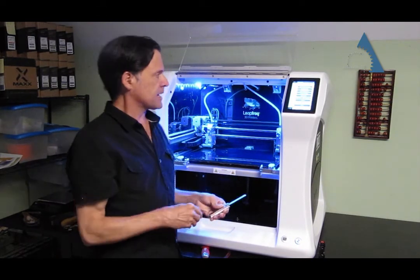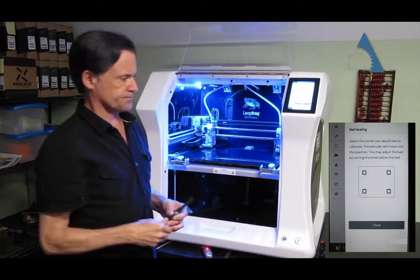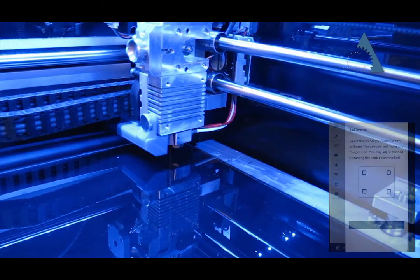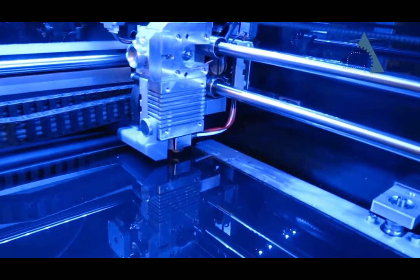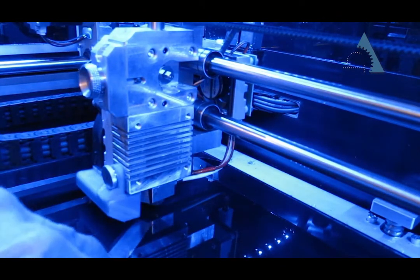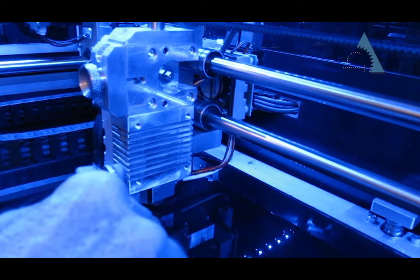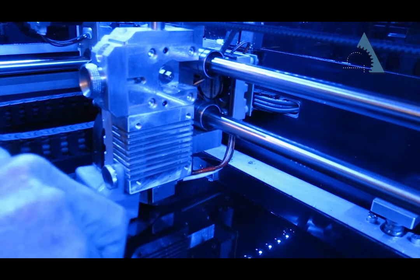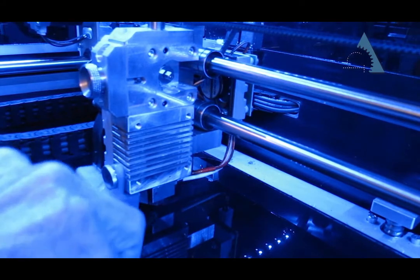Once you get the heads all clear, you want to go into Calibrate Bed, and then go in to calibrate your nozzle. Once you're in the bed calibration mode, you select your four positions. What you want to do is come in with the shim. You can see it's quite loose here going underneath the extruder. Reaching below, you turn the thumb screws. I'm getting a little bit of drag there — pretty nice. That's about the right feeling.